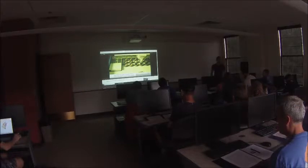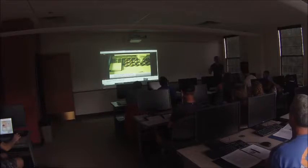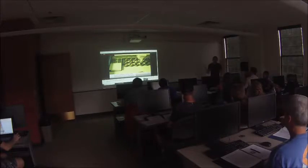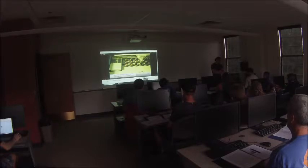Plasma systems, by contrast, are really cheap. You can get a little handheld plasma torch. Plasmas are much, much safer for handheld use, because if you think about that jet of plasma, it doesn't go out very far. And actually, most of the way the electricity works, you can't generate a plasma in the middle of air. It has to be up against something for it to work.